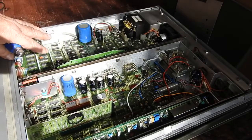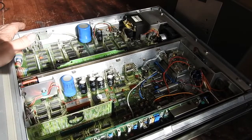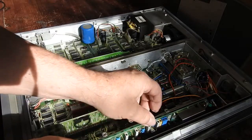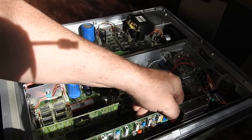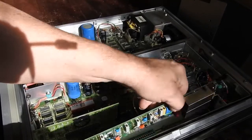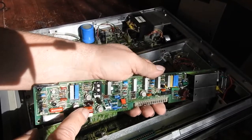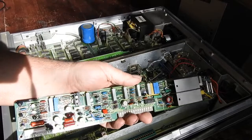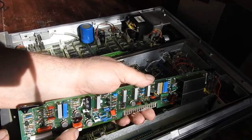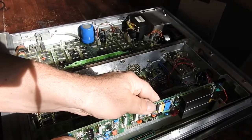There's no electrical connection between the two sections, so all of this can float relative to both ground and the digital section. I can't see anything in here that looks burnt out. The only slightly suspicious thing is that capacitor there, which looks a little bit dodgy — but capacitors shouldn't explode, or at least shouldn't make that much smoke. There's nothing obvious.